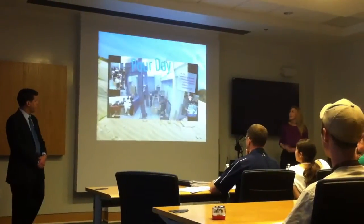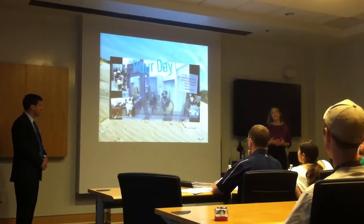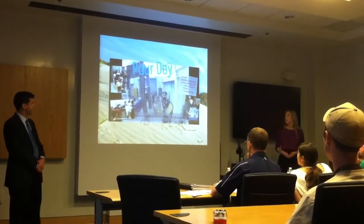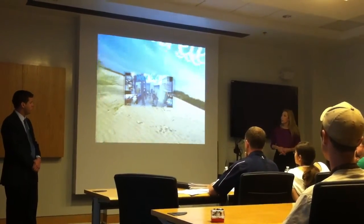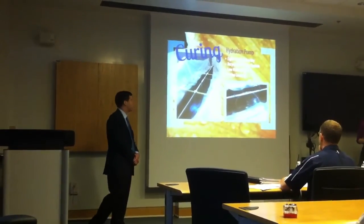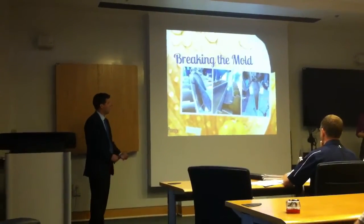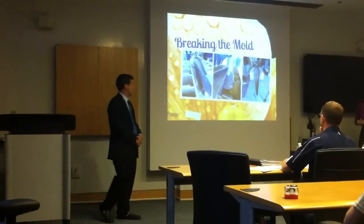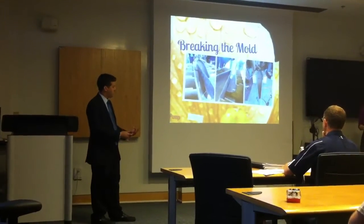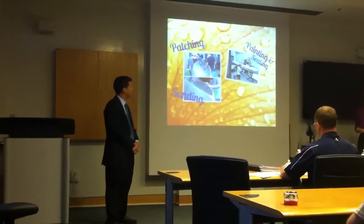On January 2nd, 18 of our members participated in the pouring of Lea. 3 teams of mixing, pouring, and quality control was what made this go so quickly. We then cured our canoe using an automated hydration system which recycled water throughout the canoe, keeping it moist for 26 days. This allowed us to work on other aspects of the canoe, such as display. Our canoe was broken from the mold in 26 days, and the next phases of patching and sanding were done.